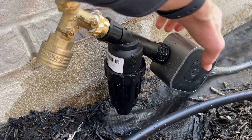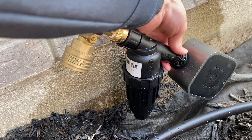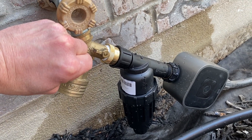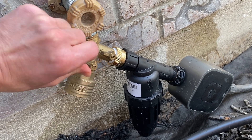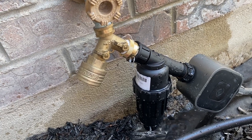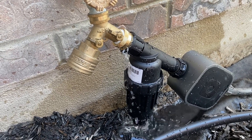Let me show you how this works. I have my drip system set up here. I'm opening the valve through the spigot and it's going in through the whole drip system. With all that pressure, say I want to come around and use my hose. When I relieve that and open that valve for my hose, all that water that's pressurized from the system is going to flow back into potentially my culinary. But what this backflow valve does is prevent it from going back into the house — look at that, bursting all the water back out, not allowing it back into the pipes inside my house. You might be able to wrap some extra Teflon to prevent this big mess, but at least in theory, it's doing what it's designed to do.